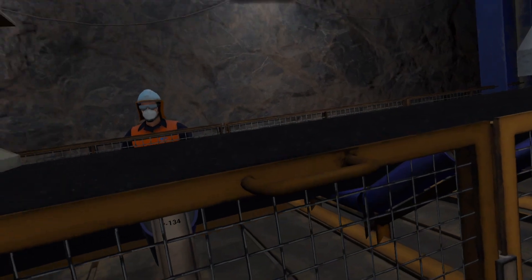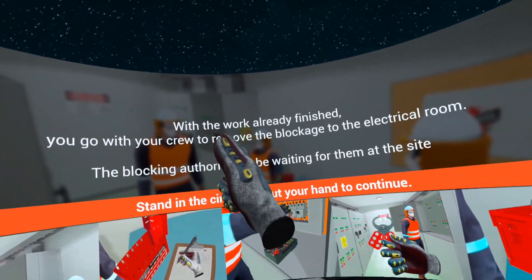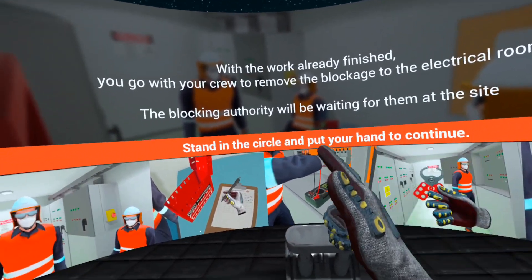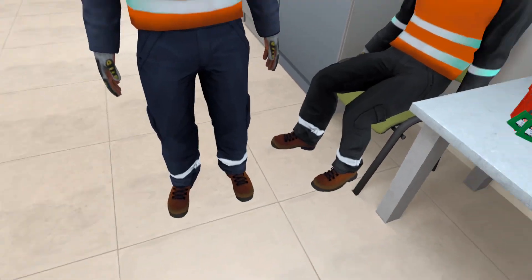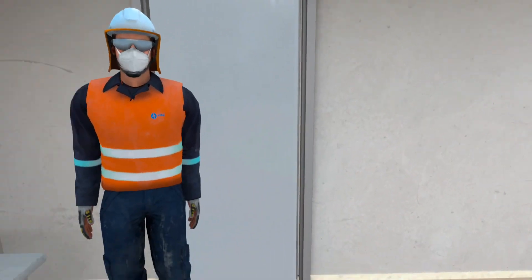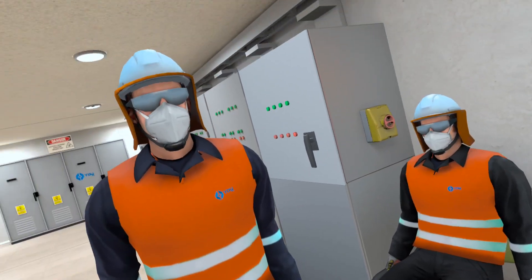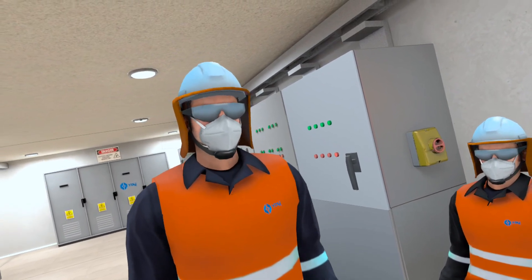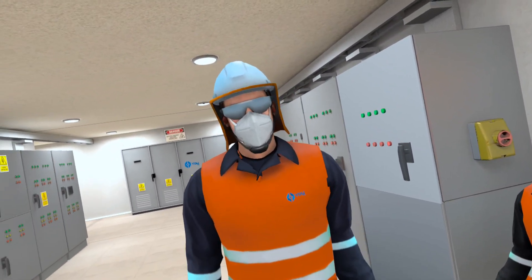It's ready, let's go back to the electrical room. Hey, and Andrew? Until he arrives we cannot remove the blockade. I hope nothing has happened to Andrew, or that he hasn't forgotten to come, since it would be a big problem to remove his padlock. You'd have to go bother the project manager, and the padlock would have to be cut with all of us present, then an incident report filed. This is not a minor issue — and it's the same if any of us lose our key, so take good care of it.